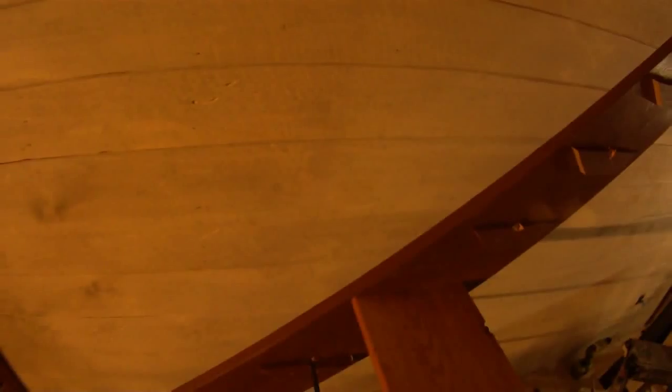Alright, so when we put the stairs in, we had a little bit of a bounce. So what we did was we put some rebar and just painted it black. These are only about $3 for a 4-foot bar. And you just take it, you put a little drill screw hole here, so it'll hold it, and then we put it right underneath. As you can see, it sits right below. It's very low profile, and it's much stronger now. It just takes that bounce out and adds a lot of strength with that steel.